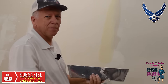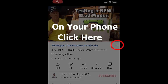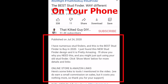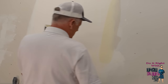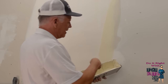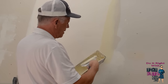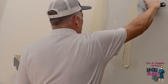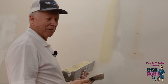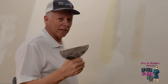The other thing it's good for is coating screws. On a mock-up like this, say these were screws on the wall — an easy way to coat them is to slide-spot it. I'll show you how to do all three at once because it's much easier. It's that same technique: put it on, lean it over as you go up, and push. Once you get this down you can coat the screws in a room in a hurry. This little knife is real handy for that.